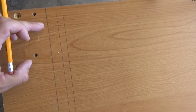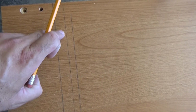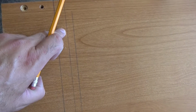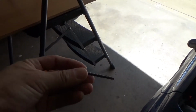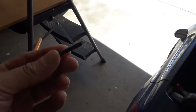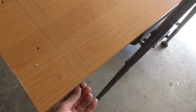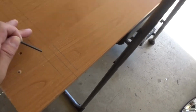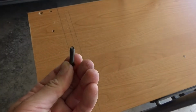What I will be doing is I will be drilling holes all the way through this board, which will basically be the start of my drill hole for some special screws. Let me see if I can find one real quick. These guys. I'm going to be drilling this screw. Okay, it'll actually come from underneath, right through. I'll probably make maybe three holes, should probably be enough. So, three holes going right through, and this will drill into the smaller boards that will suspend our shelf.